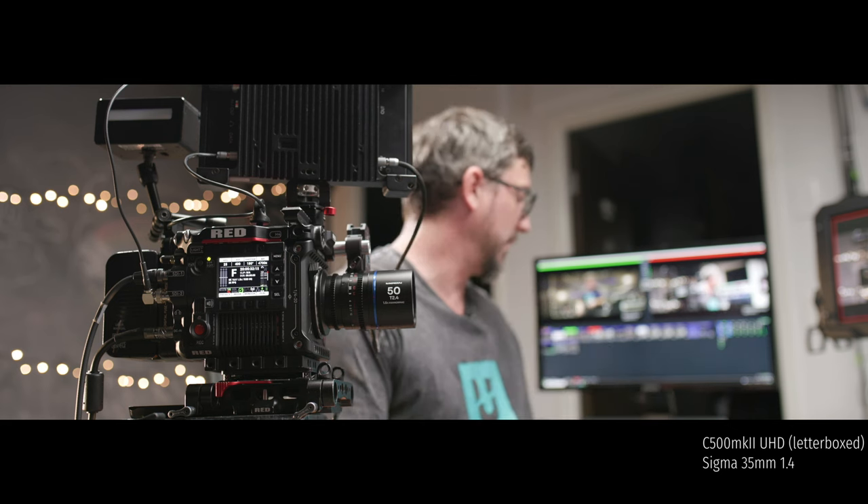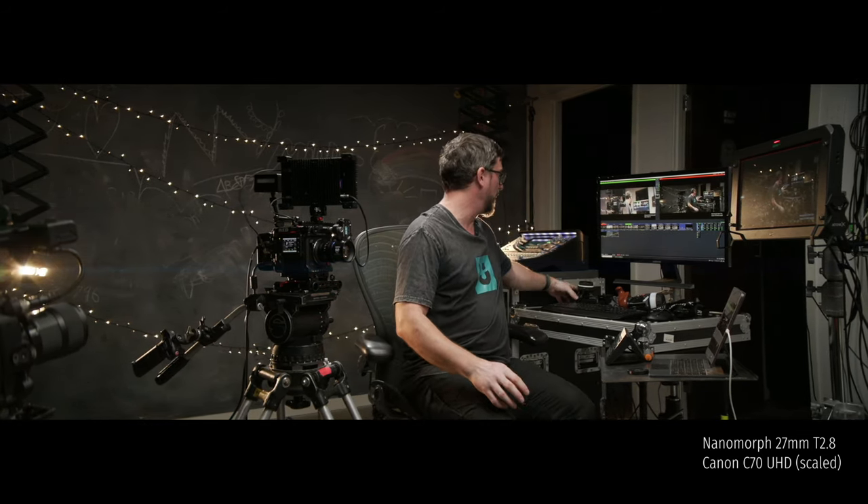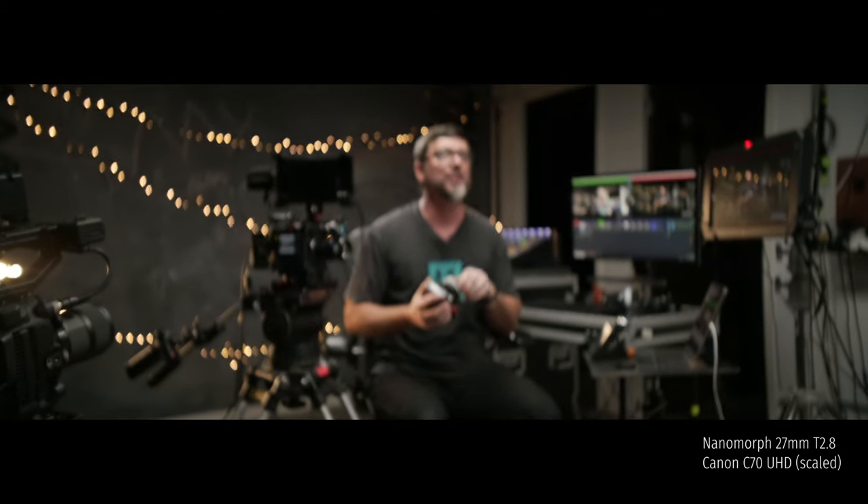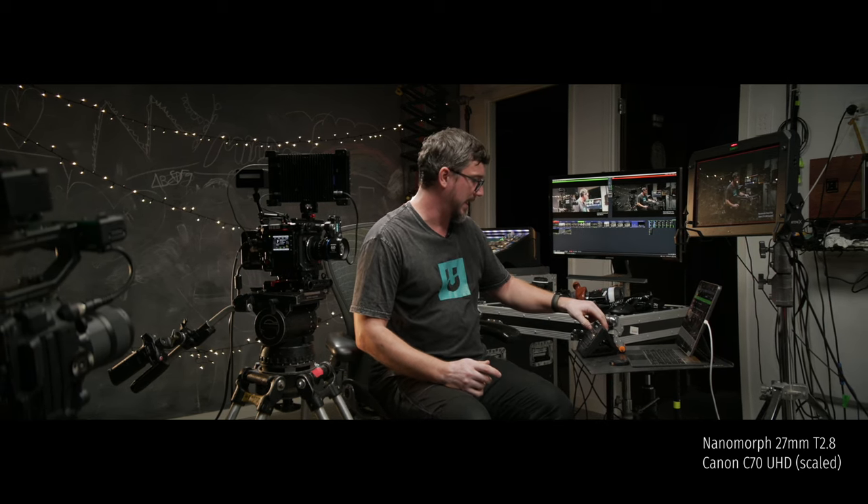Let me take you around and show you the different camera angles so you get a feel for what we're going to play with today. We've got a C70 here on a Red Rock Micro one-man crew, providing a nice little autonomous dolly angle with a slight curve so it holds its focal length. I've hooked up the Nucleus Nano motor so I can pull focus there. You can see the little oval bokeh of the fairy lights I've put in the background — both for technical purposes and because it's almost Christmas. Next up we've got a Red Komodo with the Orion 40mm for comparison, running at 6K 4x3, 2x — the 2x referring to the squeeze factor of the anamorphic, so how much it's squeezing the world optically into the sensor, and then in post you stretch it back out to get all the funky awesomeness of anamorphic.